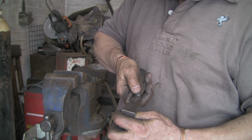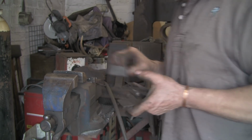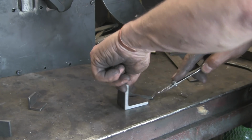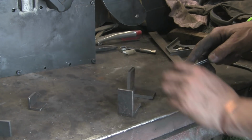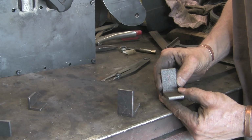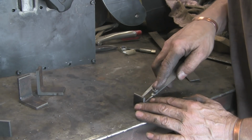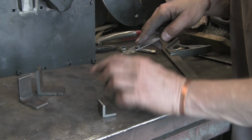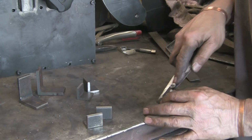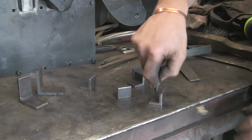Right, so same old job. Mark down the middle. That way, obviously going to do it on this side, and then mark across there to drill them. So, mark them up. If you can see that little cross, yeah, you can see that quite well. So we'll centre dot them, we'll just do the rest of them. Do the little ones. And these are going to be different, so I'm just going to whiz across the centre of these first, and then across the other edge with a slightly different dimension. Give them all a centre pop.